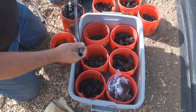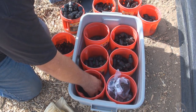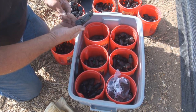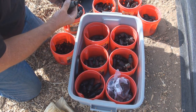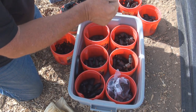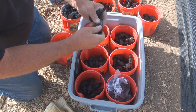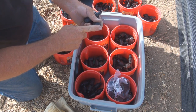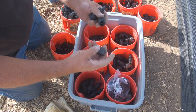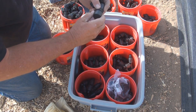So your fittings are going to be a little different if they're going to get tight and hold the water pressure. These are mainline parts, and I'll show you the difference. This is a capped end to a hose bib, and we'll use these a lot. We'll put a one-way valve on this so that at minimal pressure it pops open and drains, and it helps you drain the lines out, especially during the winter. You can drain your low points. But this is typically that.